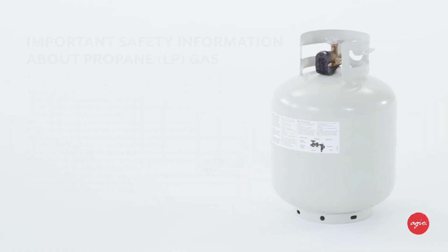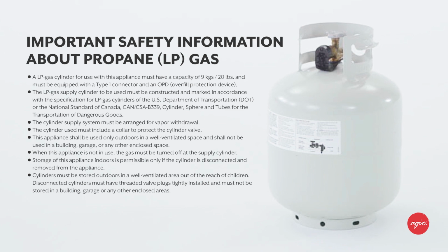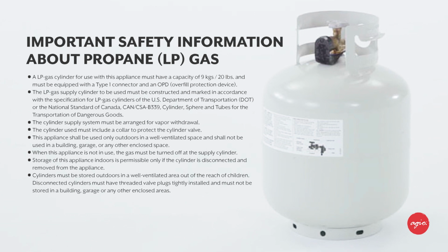If you are using the fire table with LP, propane gas, you will need to supply your own LP cylinder. The cylinder must have a capacity of 9 kilograms, or 20 pounds, and it must be equipped with a Type 1 connector and an OPD, overfill protection device. Consult the assembly guide for specifications on the cylinder, and be sure you're following all safety guidelines.